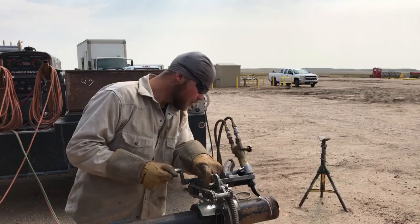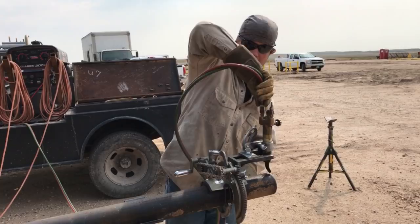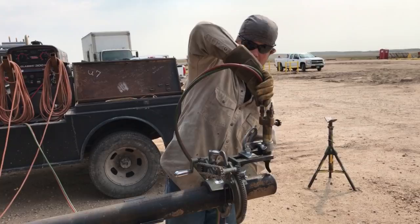Watch your hoses when it's all done. Acetylene off first, oxygen off last. That goes for every size of pipe — same idea every time. Might be a different kind of bevel machine, but easy and clean — that's how you cut it.